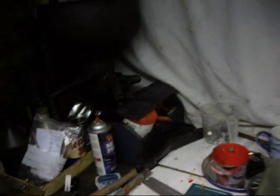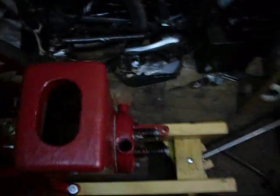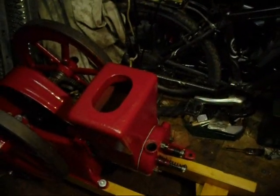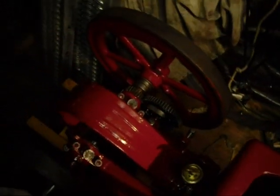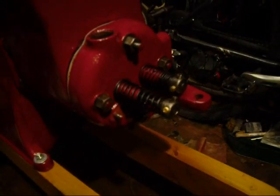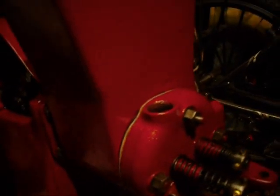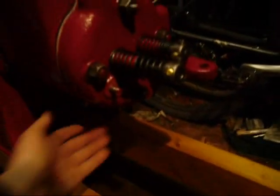Obviously that needs painting - it was painted at some point with non-heat-proof paint so it's all bubbled when I put it on the Wolseley, but I've got some Blackfriars high-temperature paint so I'll get that sorted. And we have a cream separator there - Dan very kindly gave me that gearbox for it, so I should be able to have that on the rally field this year. I was getting some really loud bangs out of it on compression - shows you just how loud this engine will be when running. Anyway, I'm very pleased - I've never made a head gasket out of this stuff for an engine of this size, always bought them, so that's quite nice. Might just get the mixer gasket and put that on.